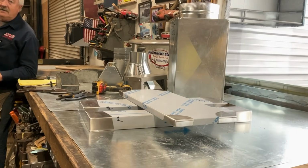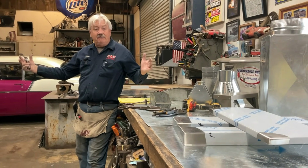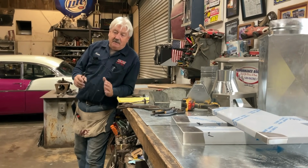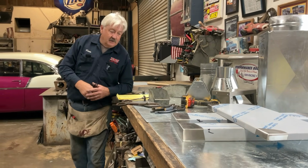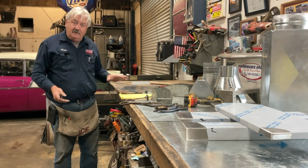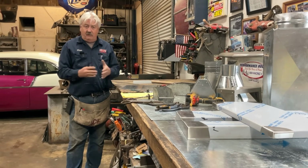If I bend the short side up over there, now I'm left with I need a 5 foot bend, and I don't have room in my box and pan. My box and pan brake only goes up to 4. So we always want to bend the long ones in the brake, in the 10-foot brake. And so then when we come back to the box and pan to finish the project, we want to always come to the box and pan with the shortest part of our project.